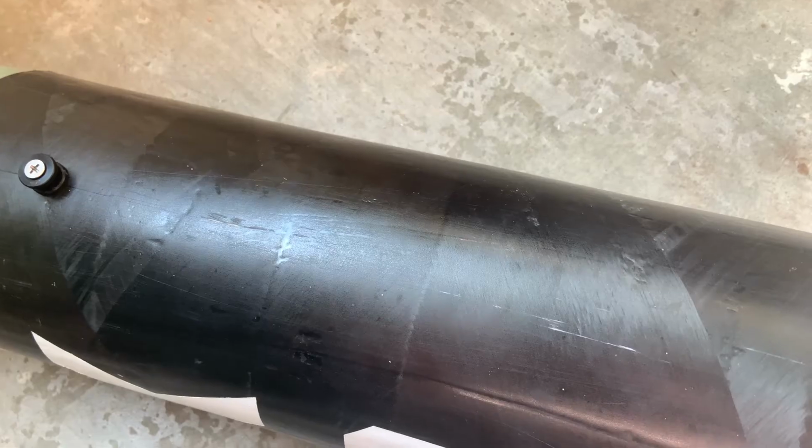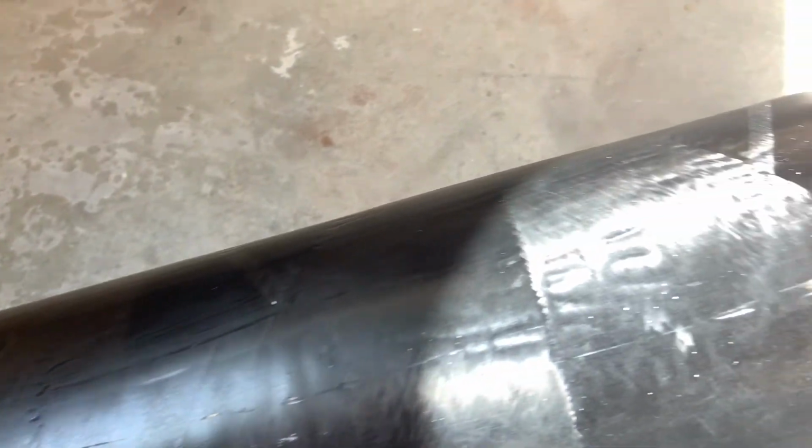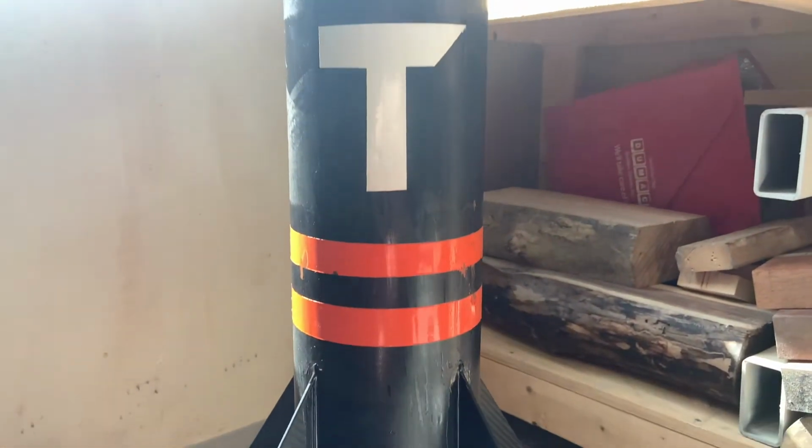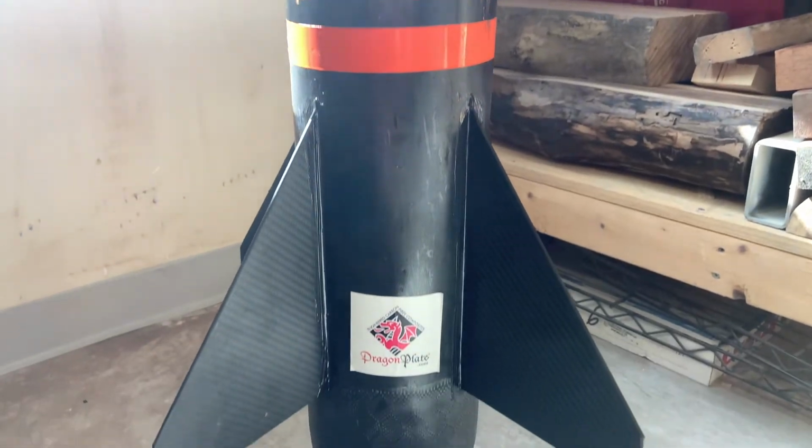winding process. This is the first year that the team has constructed custom tubes, and extensive experimentation was conducted in order to tune the process parameters. Initial tests were conducted at a 3-inch diameter and then scaled to the 6-inch mandrel. The filament winder uses a roll of 6,000 carbon fiber tow and wets the fiber through an epoxy bath. That fiber is then spun onto the aluminum mandrel.